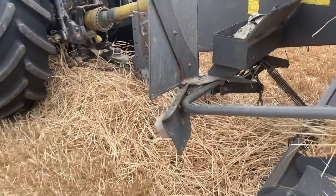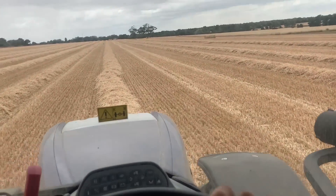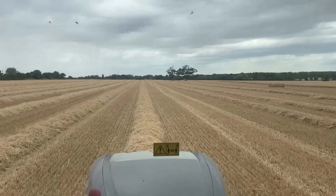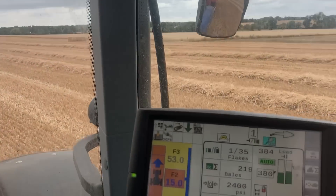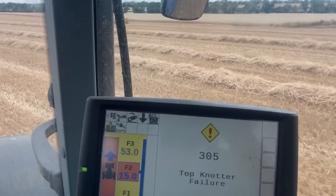There we go - put the knife back in the toolbox, shut the toolbox, and off we go. We're off and going now - it's a lovely long field. The combine is probably about 18 or 19 foot - I think it's a 5.4 metre head. We just retied the first bale. It's not a very nice place to be under here. This was blown down this morning but basically this string would come out, so you have to thread it back up through the needle and back around to start another one - it's an absolutely foul job.